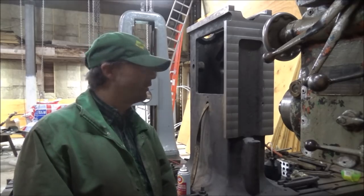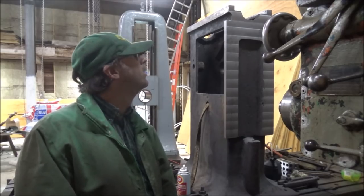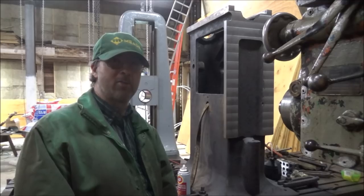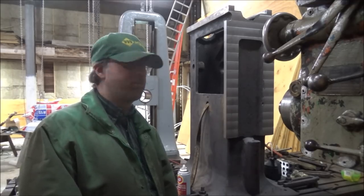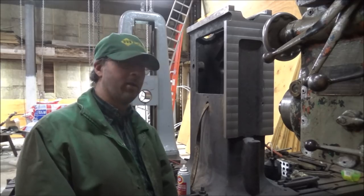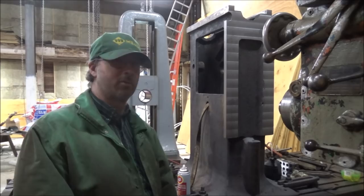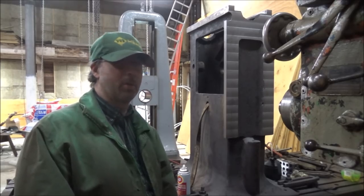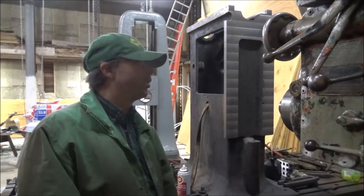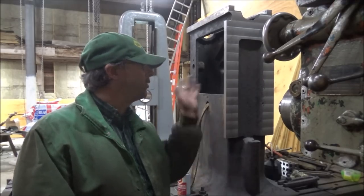If you would fly cut this and try and hold a tolerance better than a thou and a half over 2 foot, I'm sure people with new machines can probably do better, unless it's on a lot of knee-type mills, I feel like would struggle with this job. The amount of weight and tipping it on the table would probably be problematic. Now you could go sideways.